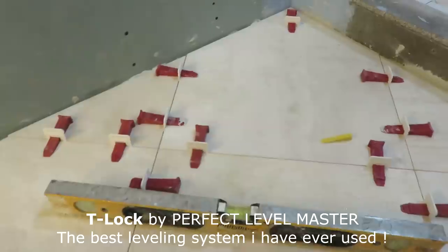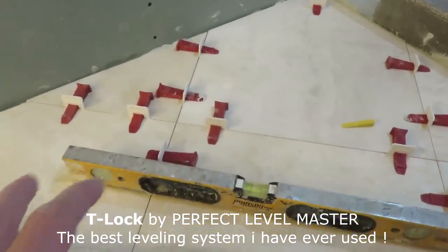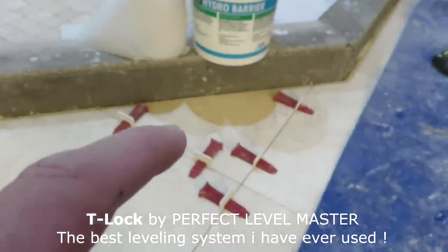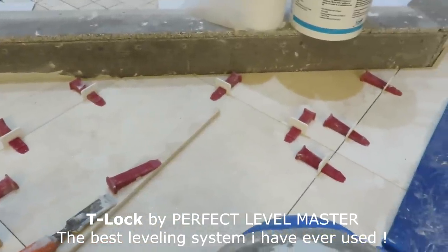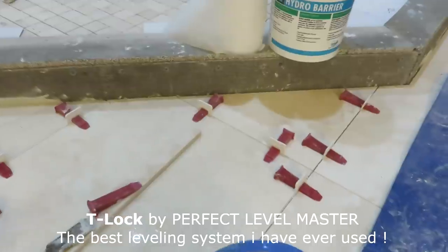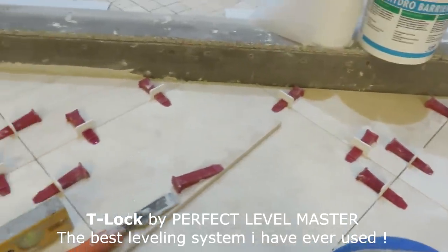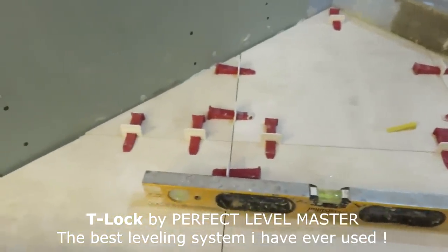I've been doing this every so often in order to remove a certain piece that needed more setting compound. I have to break the piece, cut a new piece, and adjust it once again. This happened to this tile actually. I was pushing this, hoping that it would work, but there was actually too much of the thinset that was bringing the sides of the tile higher than this tile and this tile, creating lippage. And I had to break it. But anyway, the section over here is done.